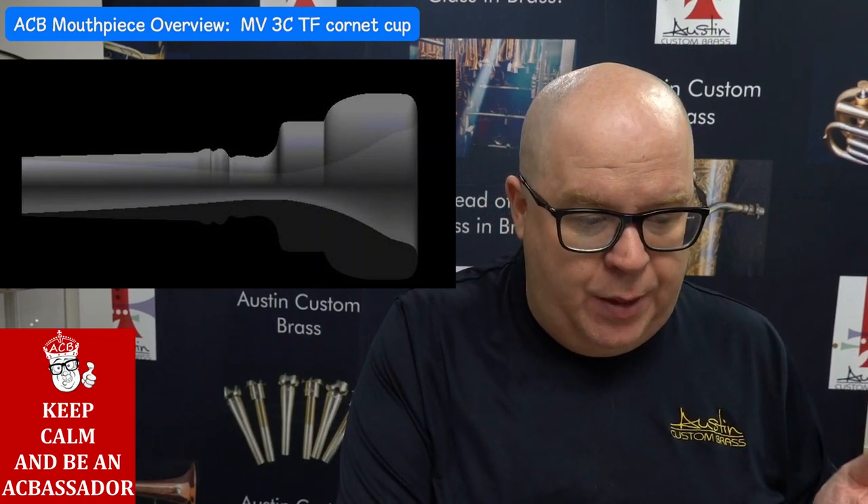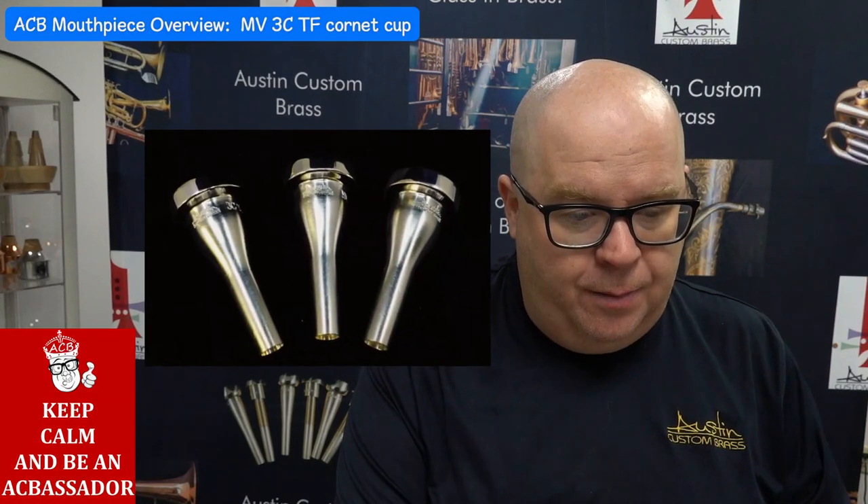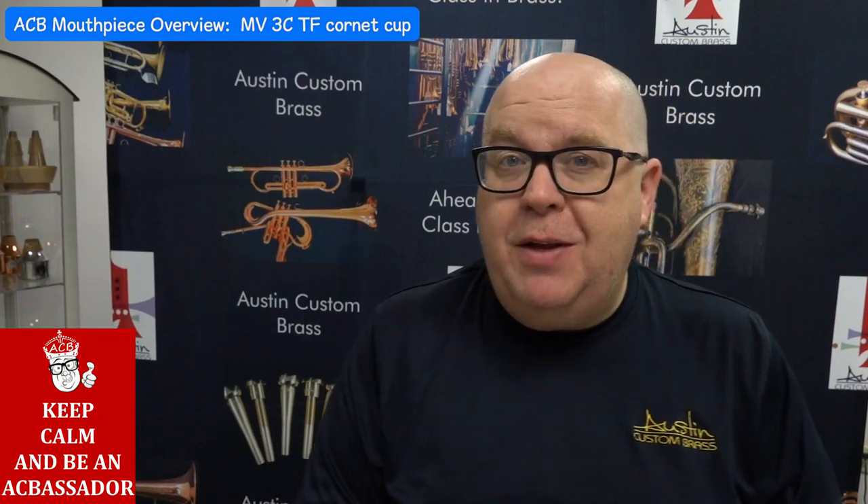That blank looks a little strange because we changed our blank. We felt like the cornet mouthpieces play a lot better for us with a slightly heavier blank. This is a little like our modern blank of the trumpet line, but not, because you can see there's less mass on the rim. When we did the modern blank on the cornet with the added rim, it turned the balance backwards, and it felt really hard to get a clean articulation. So we use that blank now, which is quite lovely.